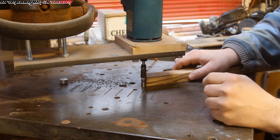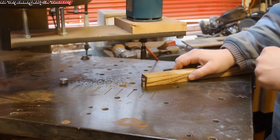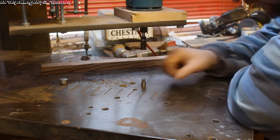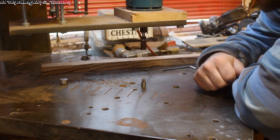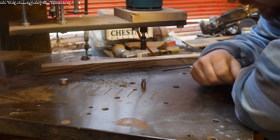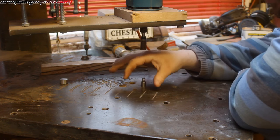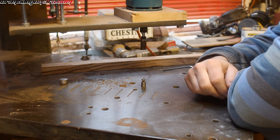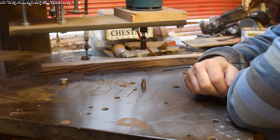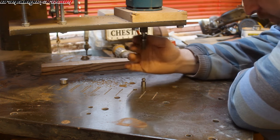It's very, very useful. I feel more comfortable with templates and bearing cutters and a hand router, but that's just because I prefer to be hands on. Now, the last thing I must say about pin routers is that you don't need all of the moving tables — all you need is up and down movement. In fact, it's probably better to have a static pin and a static router that never moves, because you'll never worry about being out of true, which I do all the time.